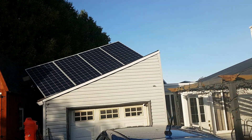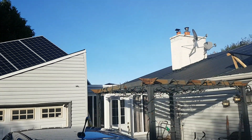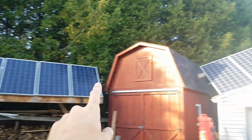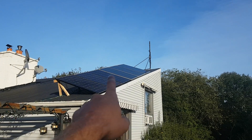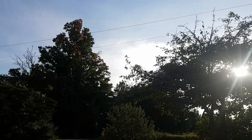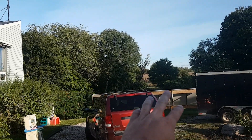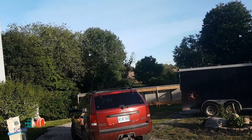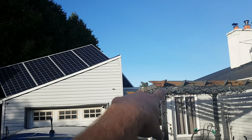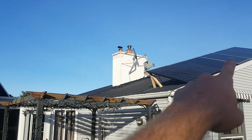These panels are in complete shade making almost zero power. These panels are only a quarter in shade and still making almost zero power — less than 50 watts. These ones are making like 400 to 600 depending on the haze. Those panels over there are making like maybe 10 watts or less — basically nothing. And then I have panels leaned up there and panels nearly flat over there, also making nothing. Pretty much these are the only evening sun power makers I have.